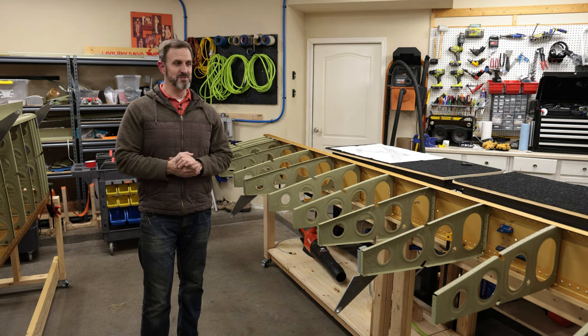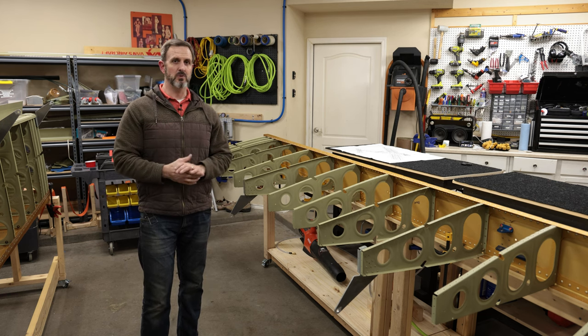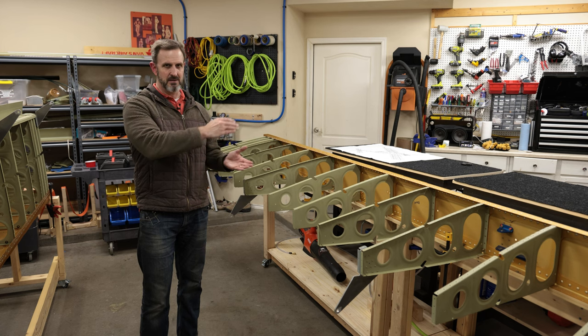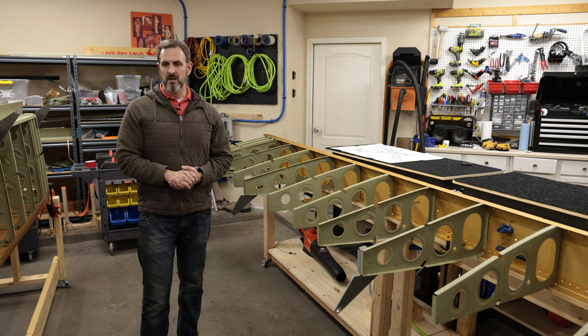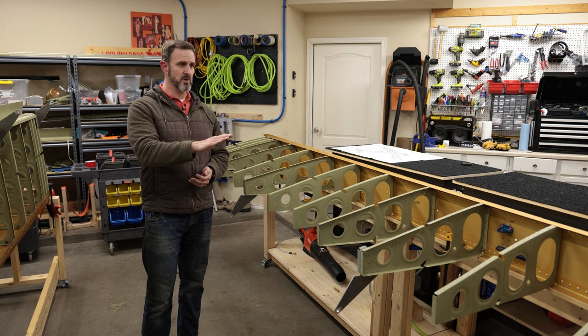So my first thought was maybe I should buy a whole new wing and rebuild it. After about 2 seconds, I rejected that idea and decided that I was going to drill out that hole with a number 12 drill bit. And instead of putting a 1/8 rivet, I put an AN3-5A bolt through it, like what's on the top and bottom of the ribs, and used that. And it fit beautifully. Pretty sure that'll work. It's stronger than a 1/8 rivet, so it'll work. Other than that, it turned out really good.